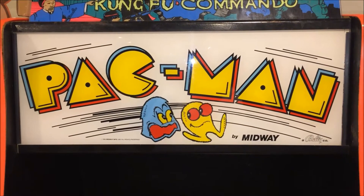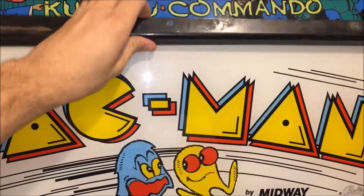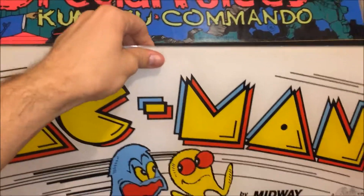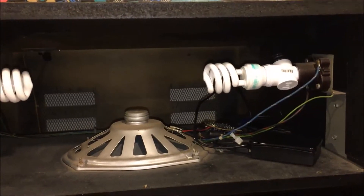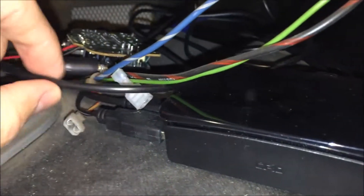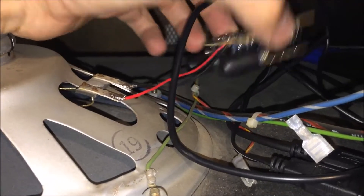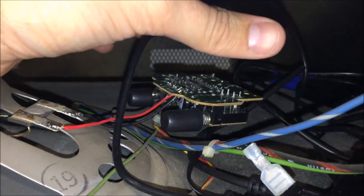So where's the fastest and easiest way to connect a Raspberry Pi to your arcade machine? Let me show you. Take off this guy right here and take off your marquee. You have AC power going to your light bulbs in the marquee. You can buy one of these little guys — I bought it at either Home Depot or Lowe's — but this will allow you to plug in your AC adapter and connect your Raspberry Pi. What I also did here is using this speaker that was original, I took a board out of an old set of computer speakers using the three and a half millimeter jack, which allows me to adjust my sound, and it works great.